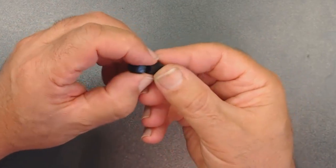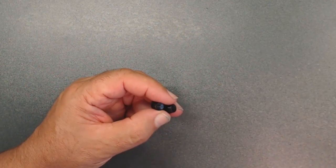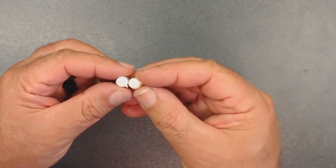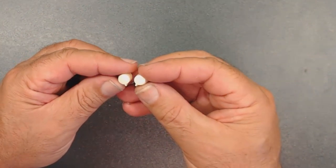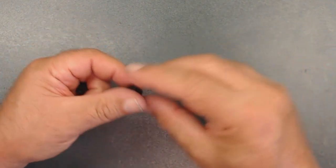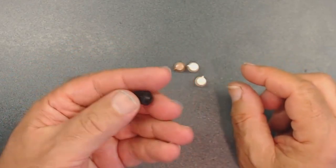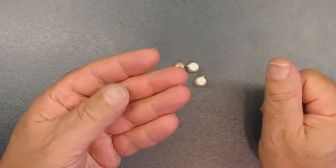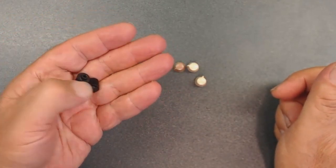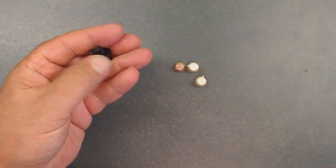Meanwhile I was looking to see if any other radios need more knobs. One of my radios is missing three knobs as well — all the knobs are missing. I have a similar radio so I'm going to make all of them at the same time. The reason is, creating one at a time means I'd have to pour and wait 24 hours to dry for each one. Since I need at least six, it's best to mold once and pour once — much easier.